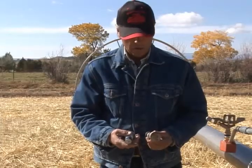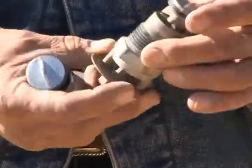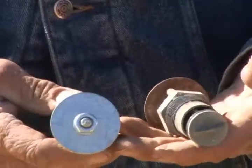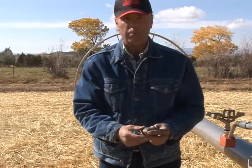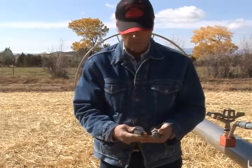The drains take maintenance also. They get loose inside, they stick open, and you'll lose a lot of water. They'll even wear and break and just shoot a stream of water into the ground. I always say I'm going to use my wheel lines to dig post holes because they will drill a post hole underneath that drain if you don't maintain those things.